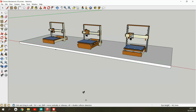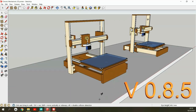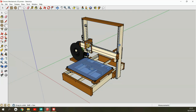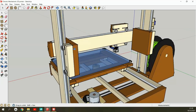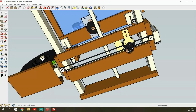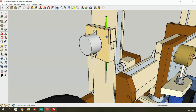Back to the printer. Over the time I worked on it, it underwent a few iterations — this here being the first one, here's the second, and the third one is version 0.9 where we're currently at right now. It's going to be made entirely from engineered wood like plywood for the gantry and MDF for the frame. The aluminum rail is just there to provide wear-resistant edges for the bearings to roll on. Basically, the linear rail system is Ender 3 style but in reverse. Having the timing belt for the Z-axis lead screws underneath the machine makes the design complex to fabricate, but it has the unbeatable advantage of not allowing the lead screws to get out of sync when the printer is powered off — plus I get to save a stepper motor. Here's the tiny extruder; it's going to be made from hardwood and screwed face down to the gantry.